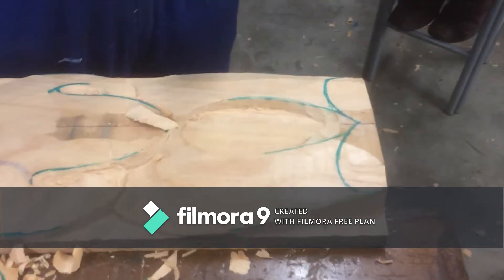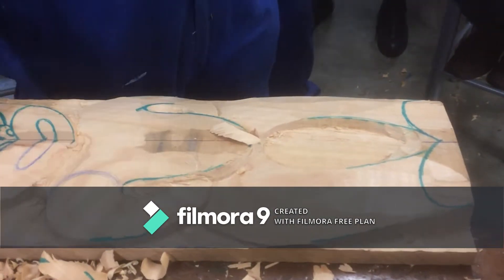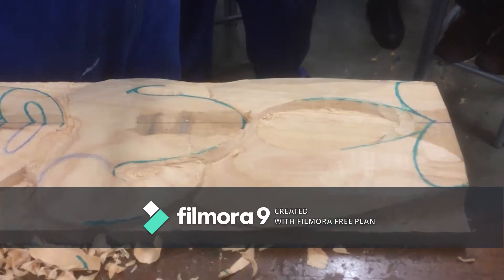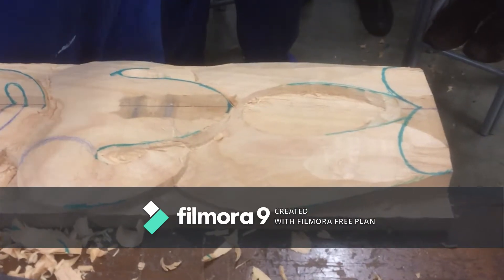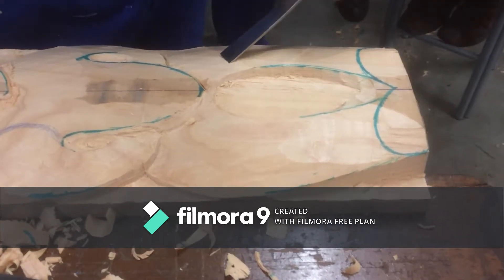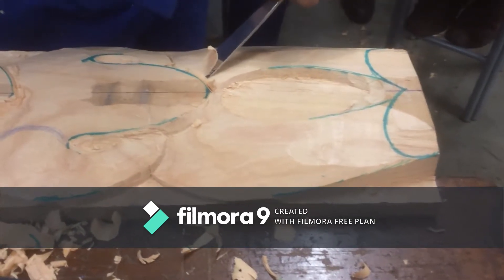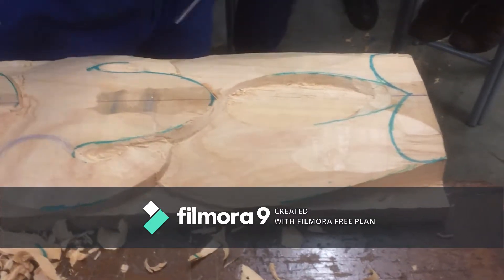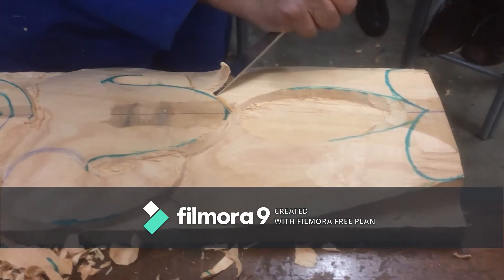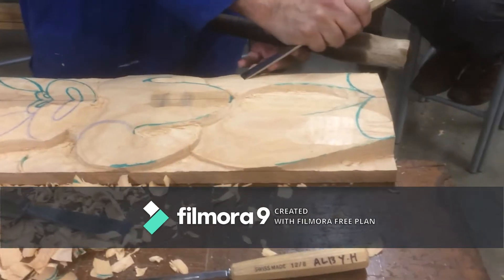You notice the hitting? Even though it's consistent, it's quite soft. Different to when I was blocking out because I was using this chisel and I was trying to get it out quite fast. But this rhythm is just as good. You don't have to rush through this to try and get it down. I'm actually taking my time because I'm practicing how to control the angle of the chisel that I'm cutting.